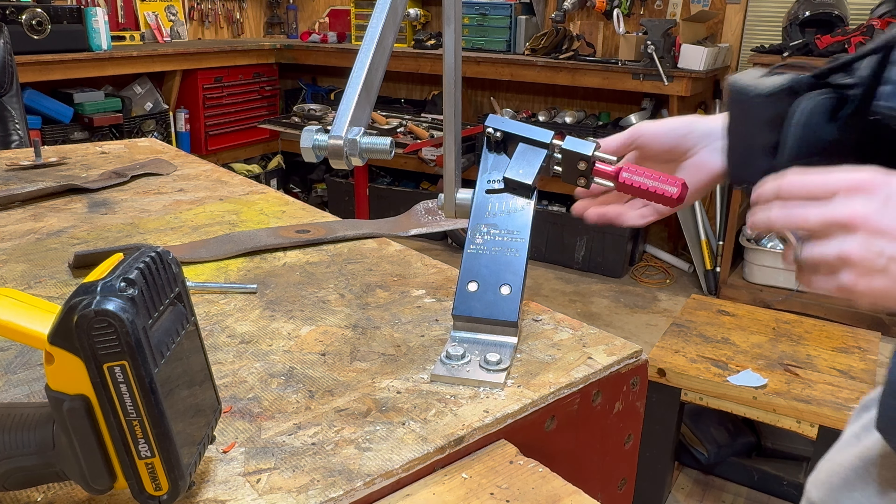This is the 5005 model. The difference between this model and the other models is that the angle is adjustable, and that is very very important. Most mower blades run about a 30-degree angle, but when you look at your mower blade sometimes this part isn't level and it'll throw off that angle just a bit. Or if you're messing with a mulching blade, you might need a different angle when you're doing the mulchers.